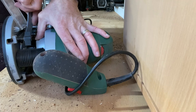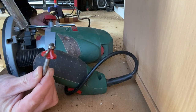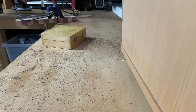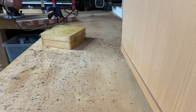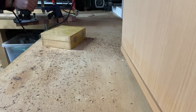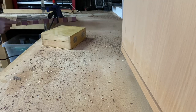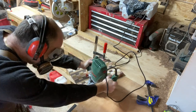Then just turn the board around and do the other side, because it's got two handles. Having done this quite a few times I'm getting used to the whole setup and routing handles doesn't take that long now. With the jig I've got two clamps on now because the jig moved before on other videos — not making that mistake again. Now we're changing over the router bit to one that gives the edges a slight round-over, because it's nice to have a slightly rounded edge on a chopping board so it's not sharp or splintery.